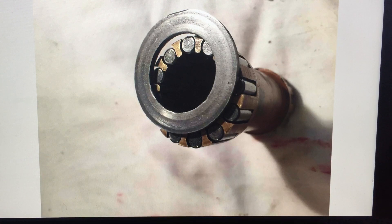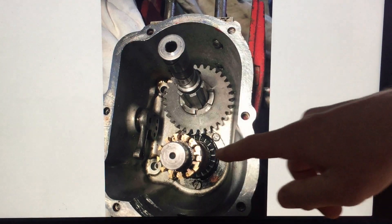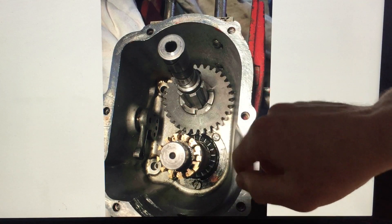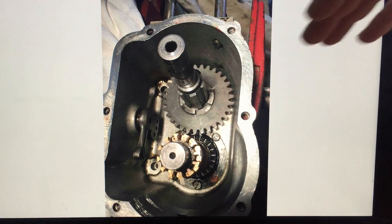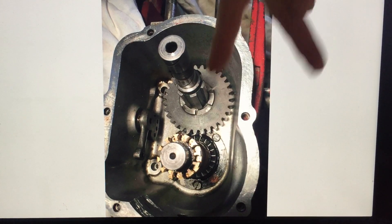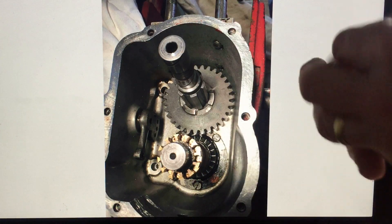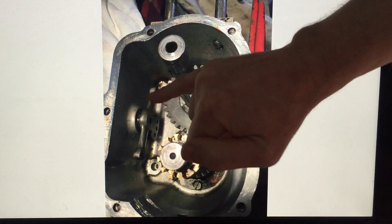The rollers are assembled with a washer on the end to hold them in. I've put this over the shaft so the bearings are up against the lower side. The important thing to remember is that when you assemble this you need to turn the gearbox upside down — with the shafts facing downwards you can slide this brass bush up and secure it. If you try any other way, those little roller bearings will pop out. At this stage I've also put in the gear selector, sliding it in from the inside. If you don't do it now you won't be able to get it past the gears later.